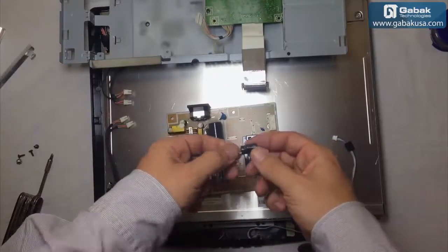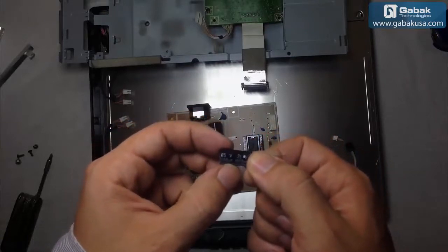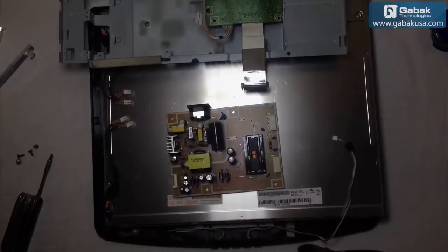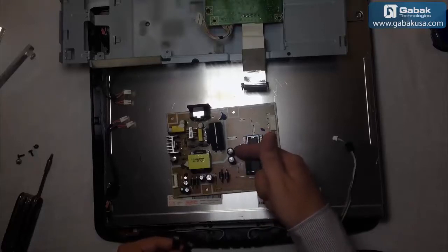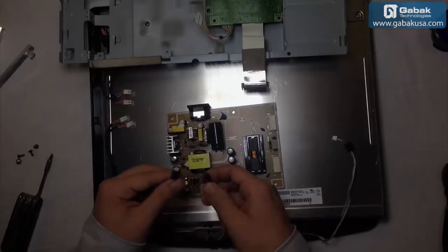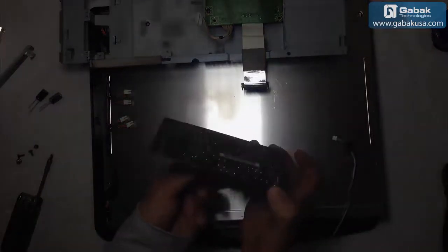In this case I couldn't find the exact same value, but here I have 25 volts and 1000 microfarad, while the original is 820 microfarad — they are very similar so it won't be a problem. Remember, sometimes people ask me if they can use something similar — yes, you can, but if you change them both. If one is fine and the other next to it has a different value, it will be a problem. So try to keep the same value for capacitors that are in the same circuit.